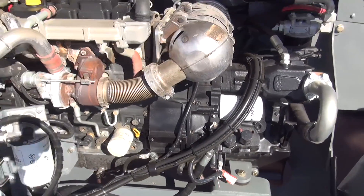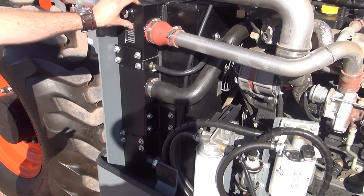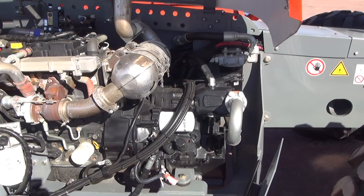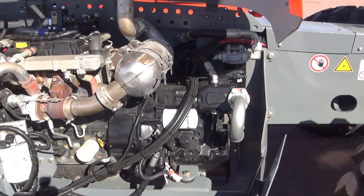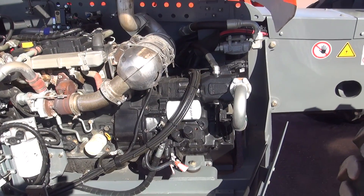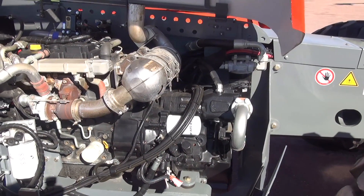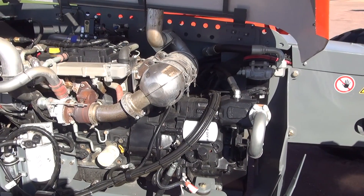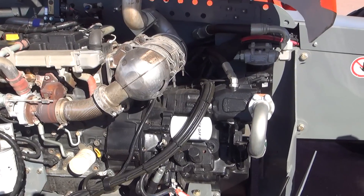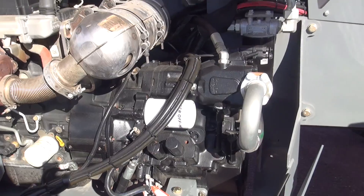Moving to the rear of the engine bay, we have set up our cooling package on rubber mounts to allow it to absorb vibration and retain its integrity in the field. Also, to increase return on investment, all Skyjack SJTH machines are equipped with an automatic declutch mounted on the service brake and parking brake, so that the transmission is automatically decoupled whenever the operator is lifting a load. This prevents damage and increased wear caused by an operator who leaves the machine in gear while on the parking or service brake and performing hydraulic functions.